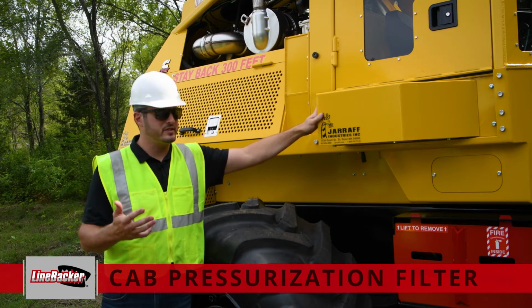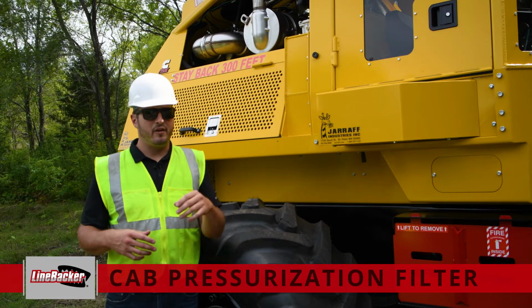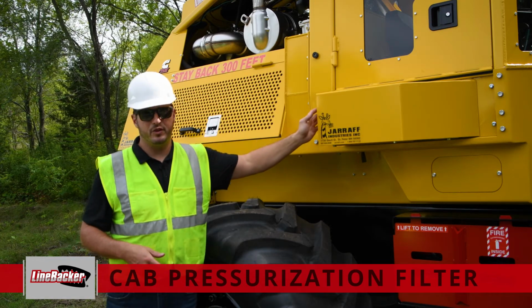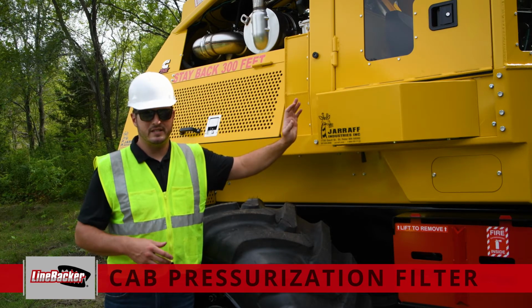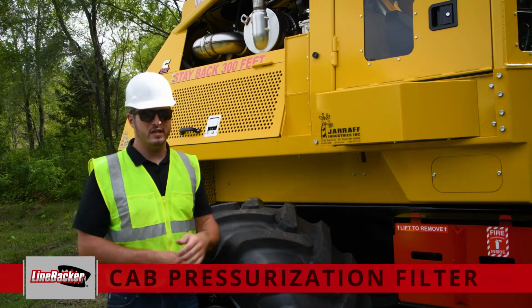The filter is really easy to change. You just undo this cover, and just like our engine air filter, it's just a cap that you take off and service that filter. So if you do notice that you have some dust getting into the cab, be sure that you are checking that air filter inside of that cab pressurization unit.